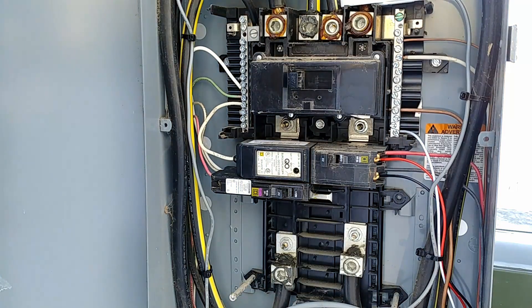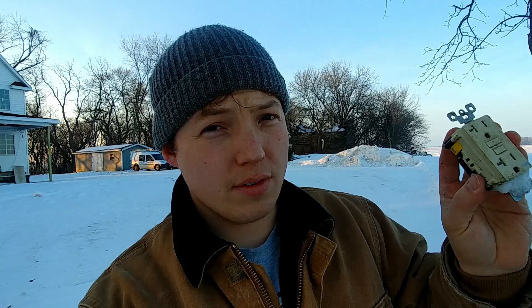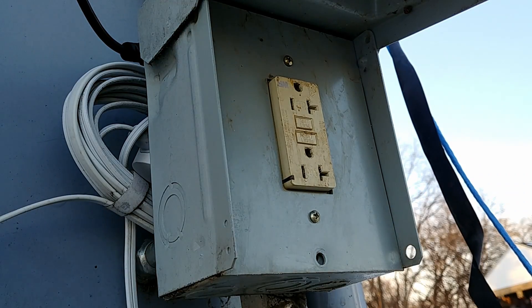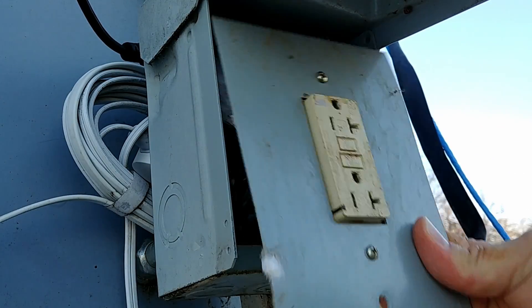So let's go replace that receptacle on the other side. It is very important that you remove any GFCI outlets that you had on that circuit. When you change your breaker over to a dual function or a ground fault breaker, a ground fault outlet will not work and it will cause issues. So you need to remove whatever ground fault outlets are in the circuit that is now being served by that dual function breaker.